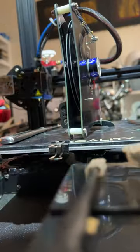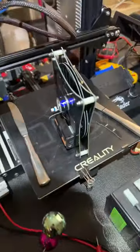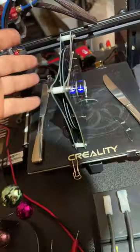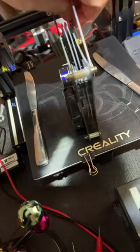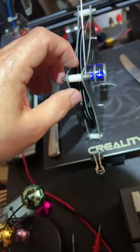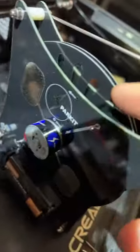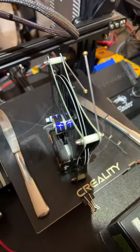Okay, everyone, what I may do is go back and read the email, so I need my phone to do that. And I'm going to go step by step and get these plates closer together. But if anyone's ever had a Wimshurst machine, or especially the Sparkit Wimshurst machine where it's not sparking between these two little metal pieces, then what I was told was that it's always, or almost always, because these plates have to be closer together, even though it seems like everything they do is on the outside.